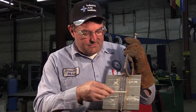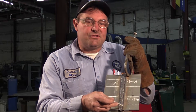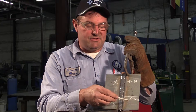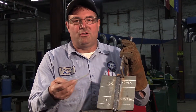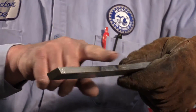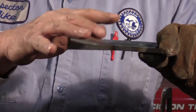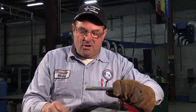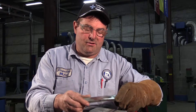The next thing is cutting to make the bend specimens. The first inch I cut and throw away, and the top inch I cut and throw away. The next inch and a half on each end is where I get my bend specimens. The center is just a backup if I mess up or need to redo something. I cut this section off, cut the backer out of it, ground the face off, and sanded it smooth to check for discontinuities. By bending this in the bend fixture I'm really stretching this face — if there's a flaw subsurface around the top it's going to show. Any flaw bigger than 1/8 inch fails. You'll see nicks, rips, cracks — any of those are automatic failures. Anything less than 1/8 inch, I accumulate up to 3/8 inch total.